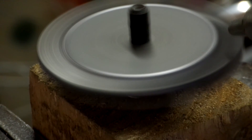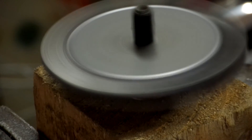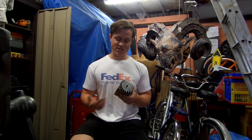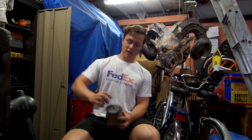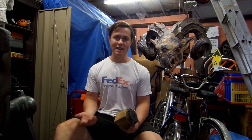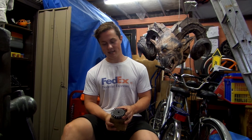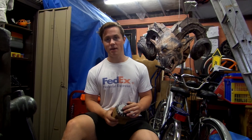If it's something simple like a water wheel, balance really doesn't matter that much. Despite the very makeshift tools, it is possible to get a fairly well balanced turbine by just taking your time and filing away small amounts side to side. You'll be able to do much better with superior tools like a lathe or a milling machine. Because I don't have any of those things, I'm really happy that I've been able to come up with something quite precise. It might not be perfect, but it's a really good start.